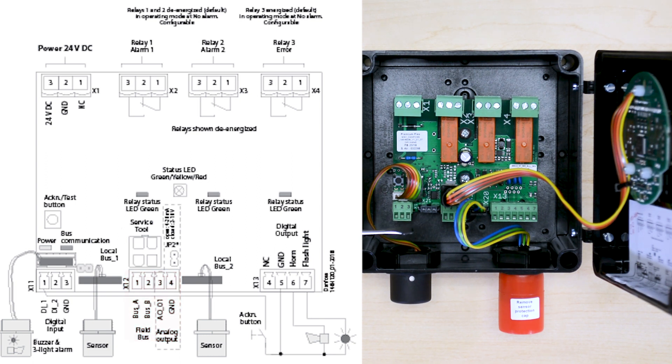If we are using a Modbus communication, wires A and B should be connected on terminals 1 and 2. If we are using the 4 to 20 milliamp loop, the wire should be connected on positions 3 and 4, and the resistor that is installed should be removed.